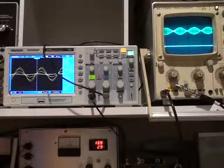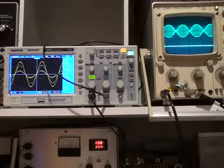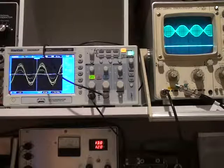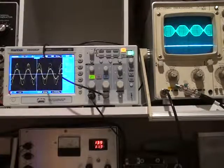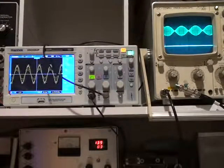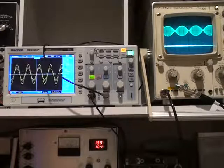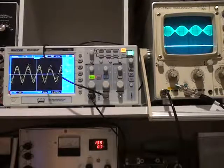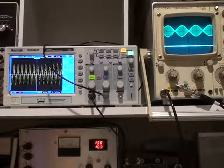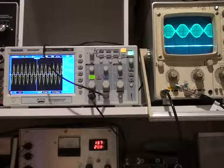Just a quick run across the bands. This is 160 meters — 100 watts on the 160 meter band. That's 100 watts on 80 meters, but there's a little bit of clipping there. I'm probably only getting about 80 watts on 80 meters for some reason — something to do with the core or component values in the PA. This is the 30 meter band, hitting 100 watts — we're actually getting 140 without too much trouble.